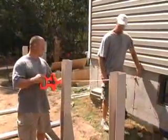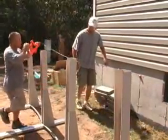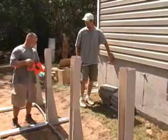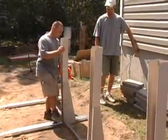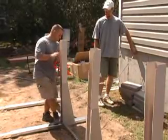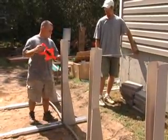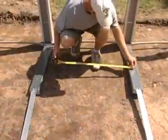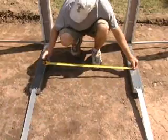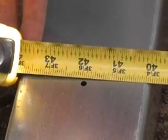In order to make sure the straight side uprights are parallel with each other, we measure the distance from the house to each upright, making sure each measurement is the same. If you are not close enough to an existing structure such as a house or fence to do this, you can draw a string along the straight sides to get the same effect. Each of the strap end channels should be sitting 42 inches on center from the channel or channels next to it.